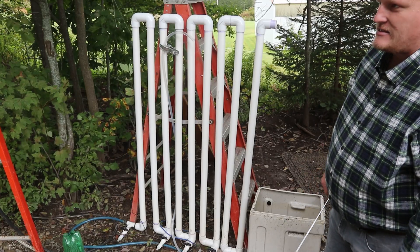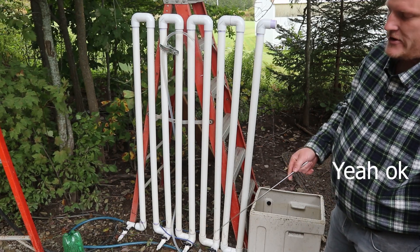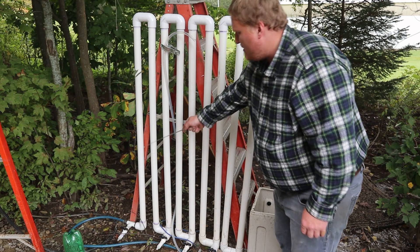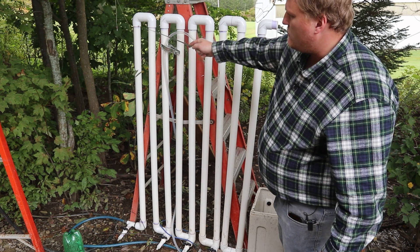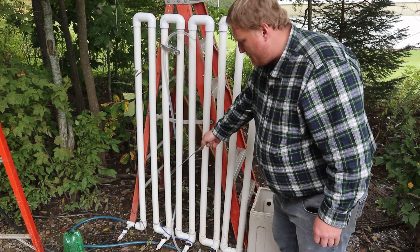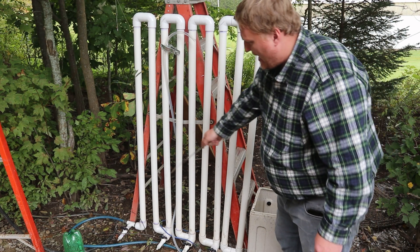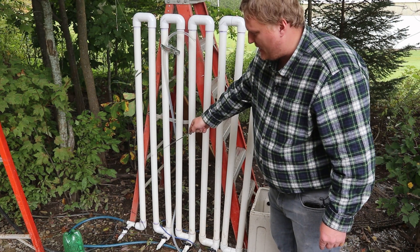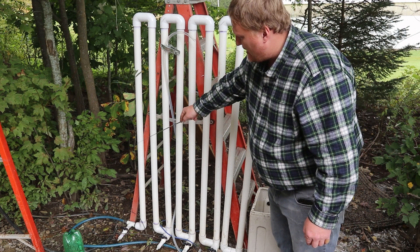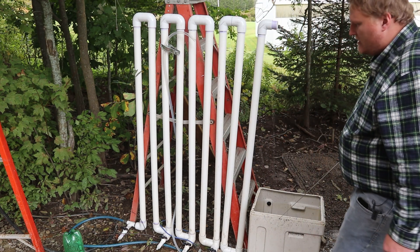Part of the reason for testing these is so that I don't have to walk up the hill 20 times to run a full test scenario on a pump. In this artificial back pressure device, we have water that pushes up the first tube and then trickles down through an air column on the second tube, and fills up and pushes up water as the third column. The third column can't push back because it's pushing against a column of air that's now pressurized. So it increases pressure for each vertical rise of water in the apparatus.